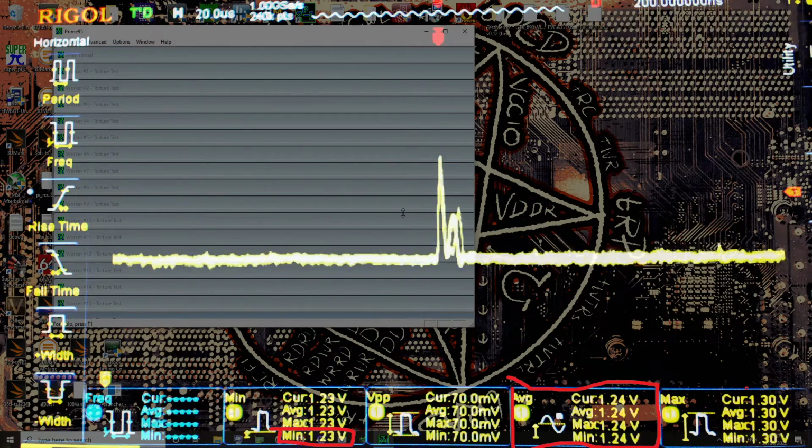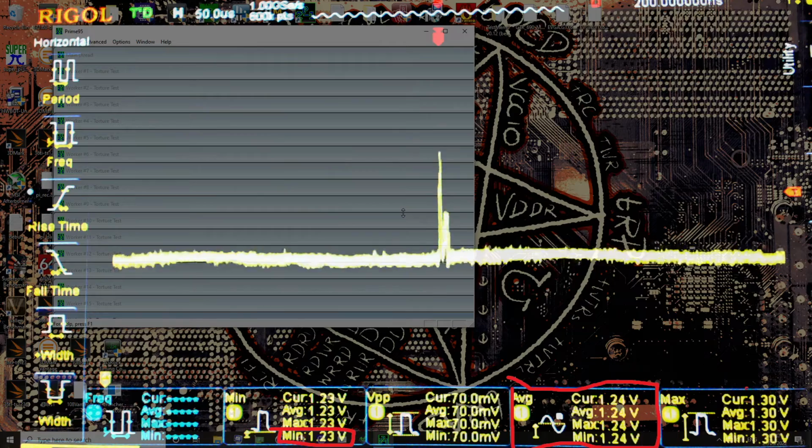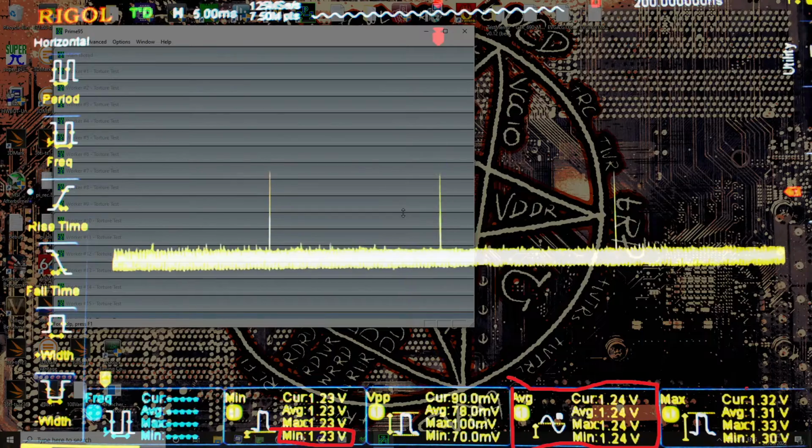I guess you could just look at the inductor current of a couple of phases, and there is equipment that can do that. It's very, very expensive. Anyway, let's zoom back out. So yeah, Mode 3 LLC does an excellent job, and it's not even crazy droopy, right? We're at 1.36 volts and we're dipping down to 1.22.